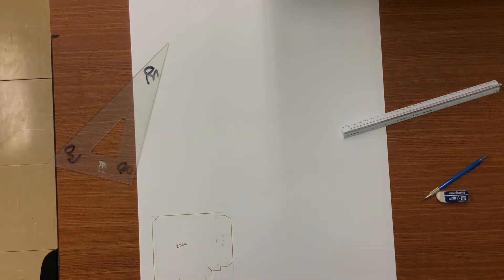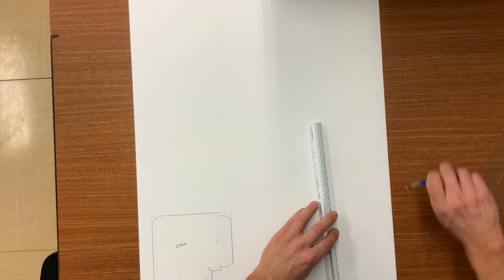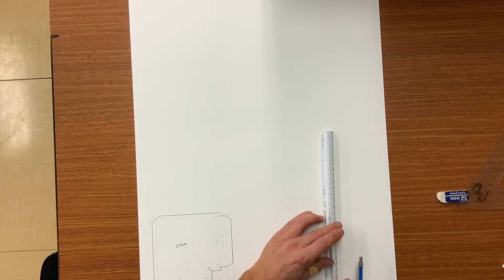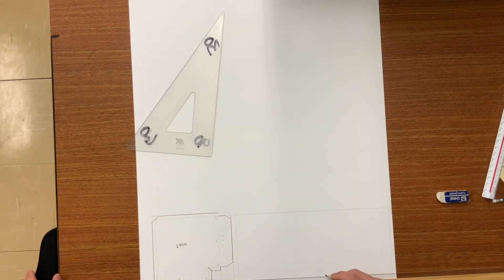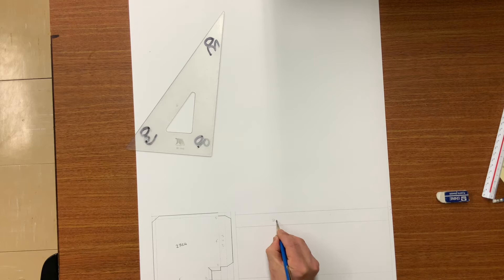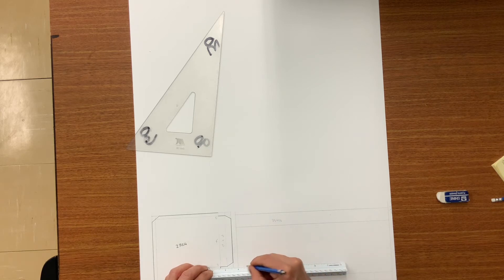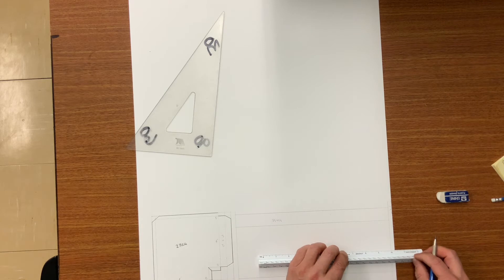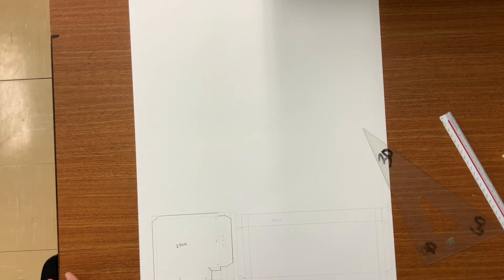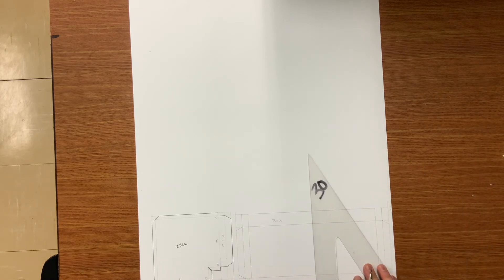Cheek pattern complete. We said earlier that the heel pattern will require a rectangle 12 by 6. Now let's go ahead and mark the one-inch allowance for the Pittsburgh lock. Now we are going to add the half and half for the S and D drives on each end. I am now marking the center of the heel, where it will be notched and bent.